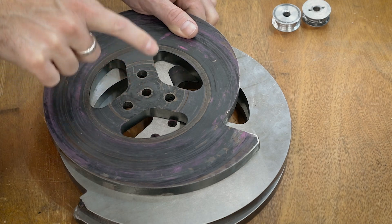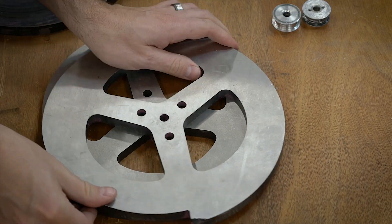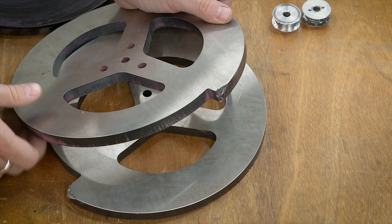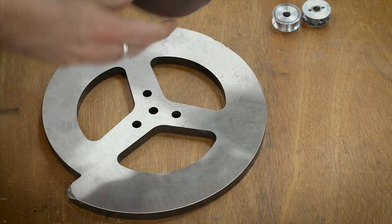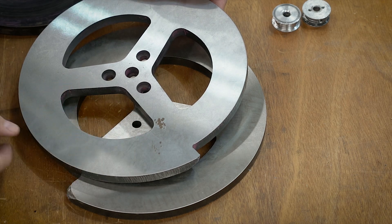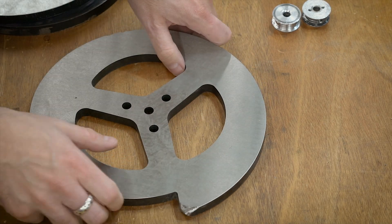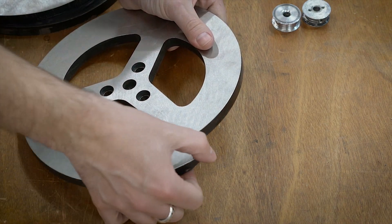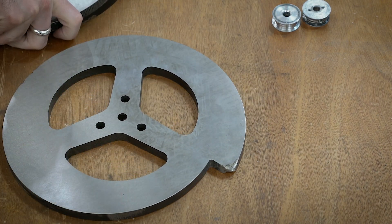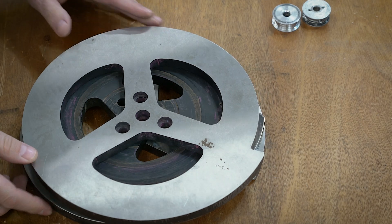This one's also a little bit unbalanced, so it wobbles just a tiny bit. Then we have the original one — these are all S7 — and you can see that the teeth have kind of worn down a little bit, so this one just doesn't have that much bite anymore. It has a little bit of a tooth on the back side; these have been surfaced down so they're actually a little bit thinner so they don't rub on the floor. Then I have the medium tooth one as well, and looking at these, the teeth are pretty chipped off.